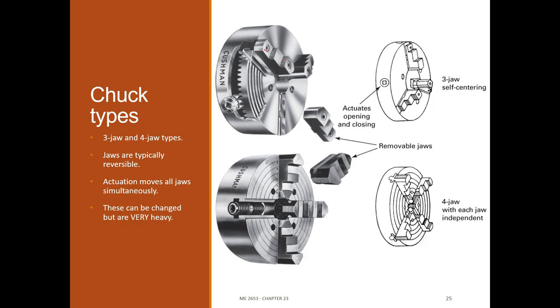Three-jaw chucks are really common - the three jaws are all keyed together and move in and out via a scroll, self-centering for anything round. If you're machining something that's not round, or if you need to machine off-center on something that is round, you use a four-jaw chuck where each jaw moves independently. You can use a dial indicator to spin the part and adjust those jaws to get something centered exactly where you need it. These are usually heavy, expensive precision items that can be damaged and have to be replaced. Generally you want to use a three-jaw if you can; four-jaws are for centering off-center or chucking non-round parts. Six-jaw chucks also hold a bit better but are more expensive.